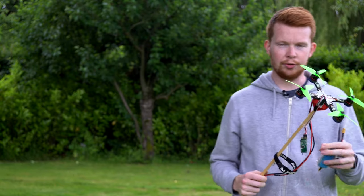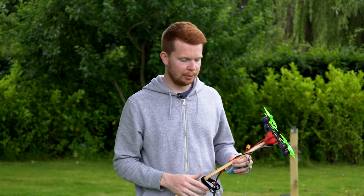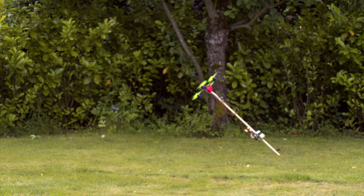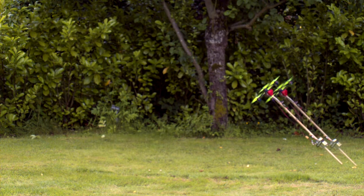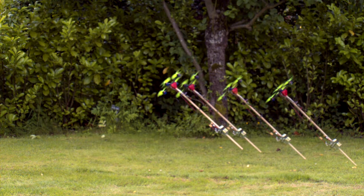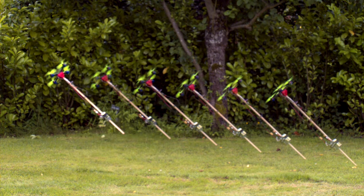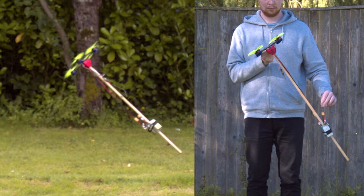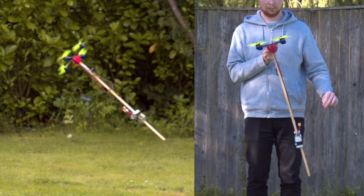I think I've made a rough conclusion from those test flights. I'm going to look at the high speed footage and then we can analyse what's going on. Here is a high speed video of the drone as it flies along, and it seems to be maintaining a constant angle. We can plot an image of the drone at points along the flight and see that they all seem to be parallel. This is a very small portion of the flight, so maybe it didn't have time to swing to a vertical position. Here is another shot of the drone being held as if it were a pendulum to give you an idea of the timescale — it's clear that the drone should level itself before exiting the shot if the pendulum effect existed.